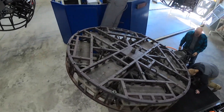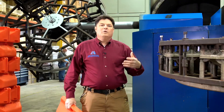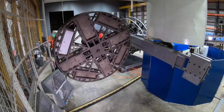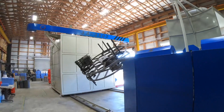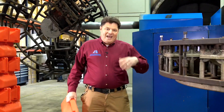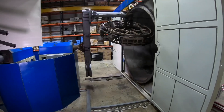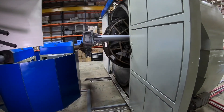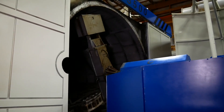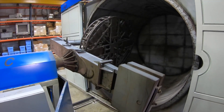There are many different types of rotational molding machines and we have several here at Ash Industries. My favorite though is the big spider arm. In the big spider arm, we have several different arms on which we would mount your molds. We have three different arms on this machine. All three of them operate independently of the others. Those molds will rotate in three different dimensions. As they're rotating with the powdered plastic inside, they're rotated around into an oven. The oven is like a small building. It puts out three million BTUs of heat. The oven encloses around the mold, even while it continues its motion.